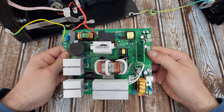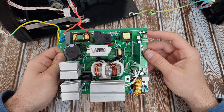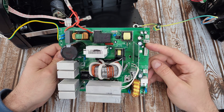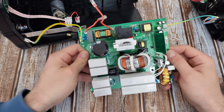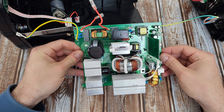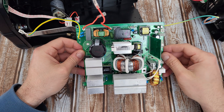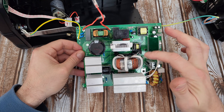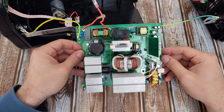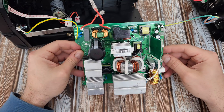Here we've got the connection for the rotation knob, the temperature check, and the voltage. The connection for the fan — here it is. The connection for the torch — it says 'torch' here. The connection for the motor — I like it. We can see we've got a huge capacitor here. Don't touch the capacitor even with the power off — it may still have some voltage.